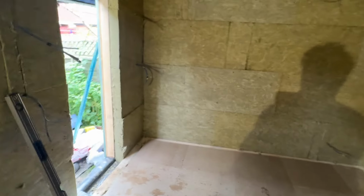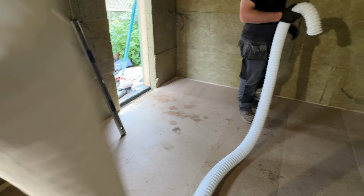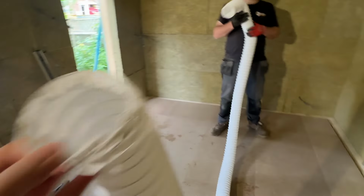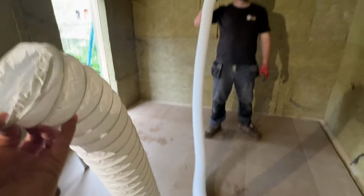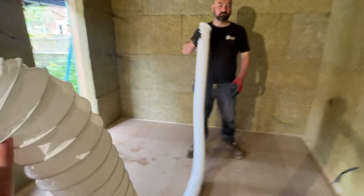Okay, that's fantastic. So you can see how, because of the nature of it, it sort of breaks up the sound waves inside that pipe. So you don't need anything too fancy. This is $7.99, right? And if it's inside the building, in the way we just described, it works. If you're using the flat channel ducting, so the smooth stuff, the sounds go straight through. Doesn't actually work. It's got to be the flexible ducting.